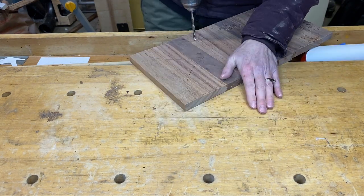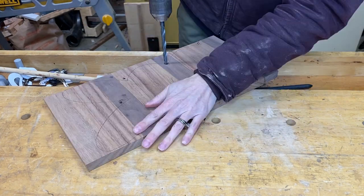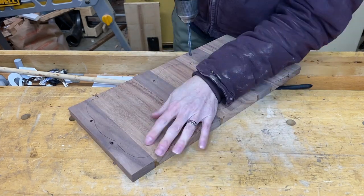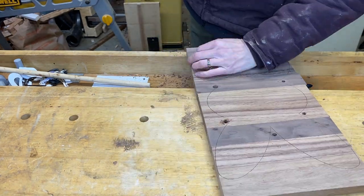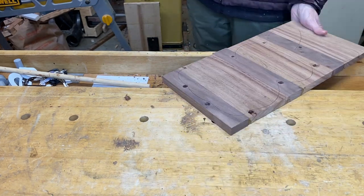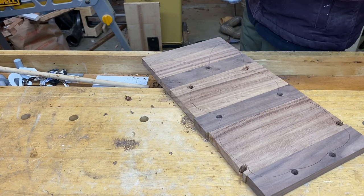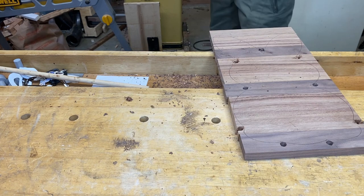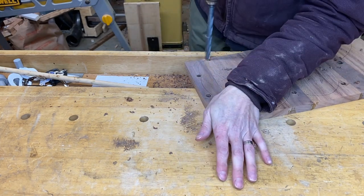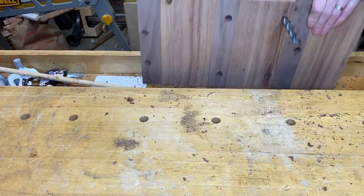You'll see a little bit further in this video why I'm putting in all these holes. You could use a drill press, and that's usually what I do. Sadly my husband sold the drill press that I enjoyed using and we now have a new giant contraption that is not that great for me to use — but I will get used to it. This was a great opportunity to show you how you can use a regular drill bit in case you don't have a more high-powered tool. I learned that if you really get the drill bit going before you put it in, you'll have a lot less tear-out. There was a little bit of tear-out and I had problems keeping the bit in the drill — not pretty, but it does get the job done.